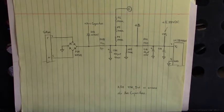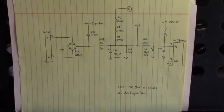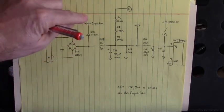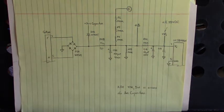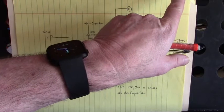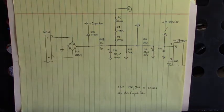Hey, now, here we are at the house. Now we're going to look at the Lafert switch mode power supply circuit that we just got done repairing. There's a couple of ways to power up the UC3844. We can power it up by applying 220 volts AC 3 phase to the R, S and T terminals, and the bus capacitors will go to about 300, 310 volts DC, and that is applied through this forward bias diode, the 10 ohm resistor here, this 100k ohm resistor here, to pin 7 of the UC3844. And when the undervoltage lockout is above that rating of that pin 7, the UC3844 starts to switch on its output.